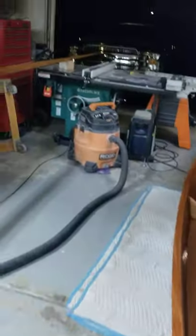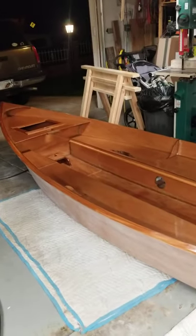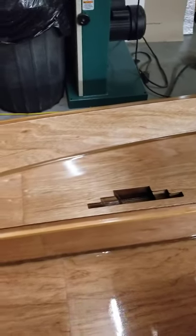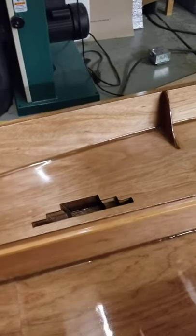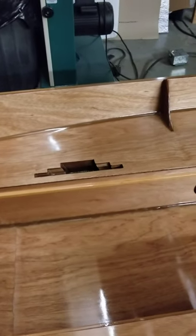I drilled out my drain hole right there, which turned out pretty well. That sleeve will go in there and then there's one of those regular rubber plugs that goes in there — you twist it and lock it down, so that should be good. I'm not sure if you guys saw the redesigned centerboard hole — there it is. I think it's going to work well. There's a little bit of play; we'll see once the board goes in the water how it sits, whether it sits flush with the top of the deck or not. I still need to make some sort of plug for that — as one of you suggested — for when I'm motoring so I don't get water shooting out of there.